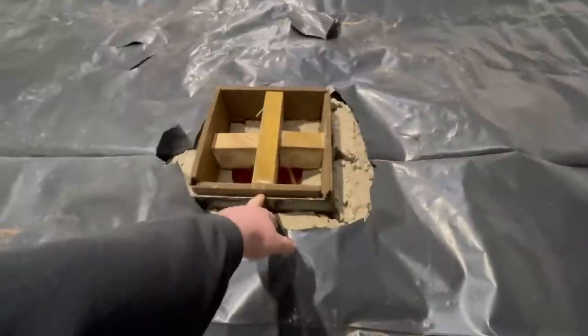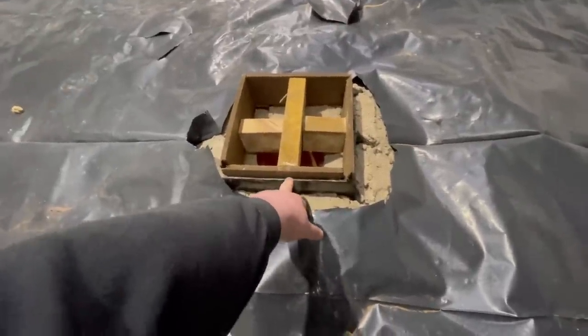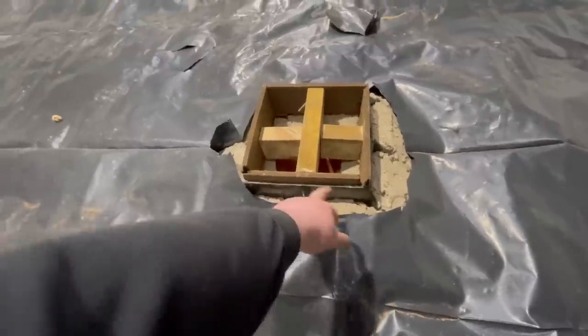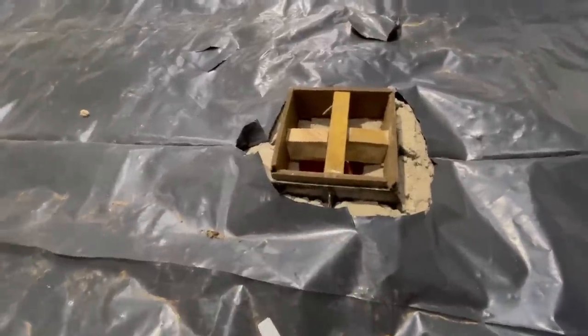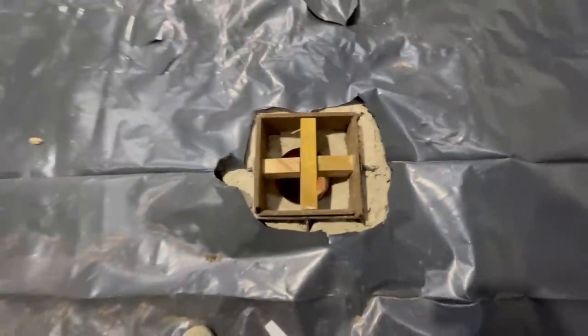Just shuttered the manholes up, because we're obviously going to set the concrete about 10, 15 mil just above this here, because when the manhole lid's on, it sits slightly higher. So when we've done that, we'll go around it with a trowel and it'll be sat about that much more, so that when we go across with the bucket, we don't pull it off. I've just put these expansion bits in, just holding it out, and then when it's done, we'll take that out.